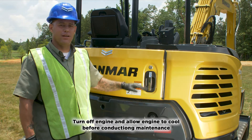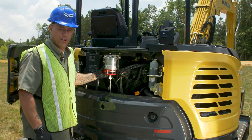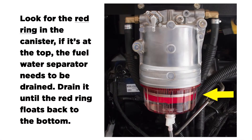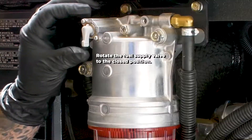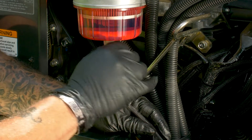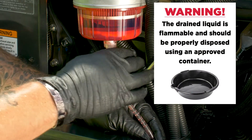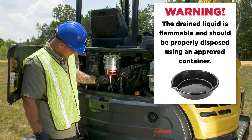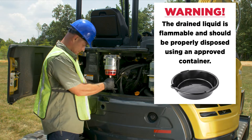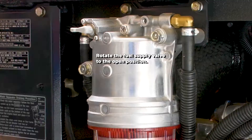The first thing on our list — we're going to come back here to the back of the machine and open up the engine access panel. We're going to check our fuel water separator. If you notice at the bottom there's a red ring. What you're looking for is for this ring to be floated up towards the top, which tells you that there's water in it. Every day you want to drain water out of this fuel water separator. Water in your fuel system is real bad on a common rail system, so we'll go ahead and drain this one. Just turn this open, let any water drain out, then tighten it back up.